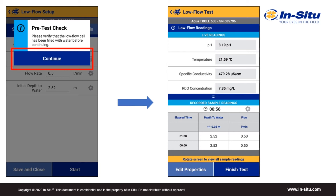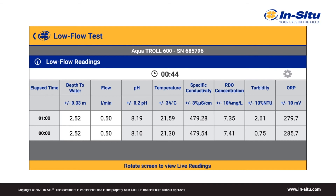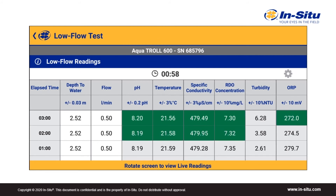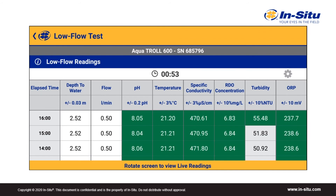If you rotate the display, you can now see all the parameters at once. While in landscape mode, you can still edit depth of water and flow measurements. As purging continues, operational and indicator parameters are measured and evaluated against the stabilization criteria. Once a parameter stabilizes, it turns green. Here we can see that pH, temperature, specific conductivity, and DO have stabilized early, but turbidity and ORP have not. Moving further along, we see that ORP stabilizes, but turbidity is still changing. Going out to 16 minutes, we finally see that turbidity is stabilized and at a much higher value than initial measurements would have indicated. Now that all parameters are stable, it's time to collect a sample.